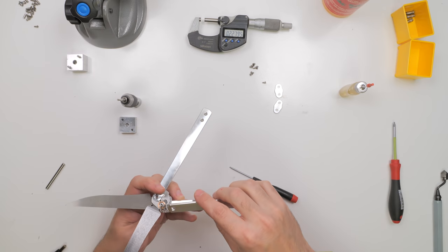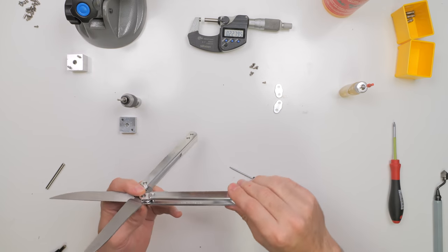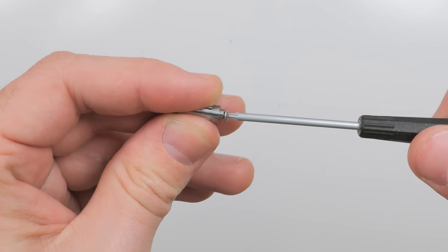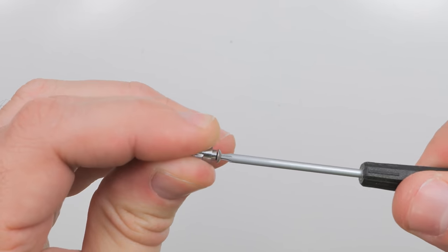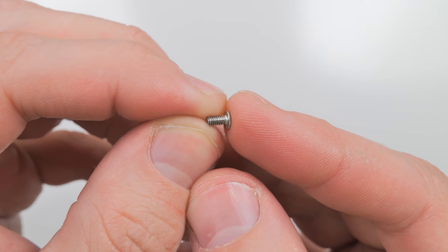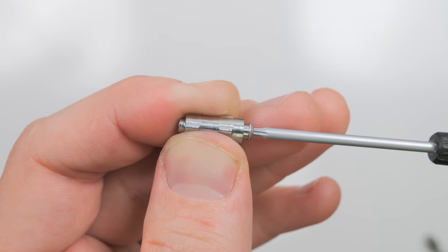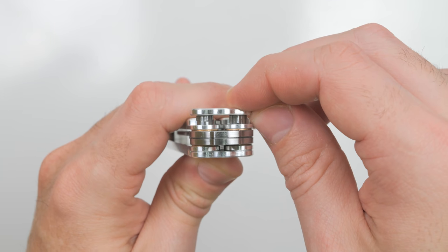After assembling these scissors 16 times, I found the problem. My screws can't tighten all the way down because they're not perfectly threaded to the head. It's tough to see on these little 2-56 screws. I added a bigger chamfer to the pins and bam, another huge improvement in reliability.